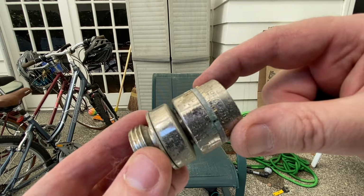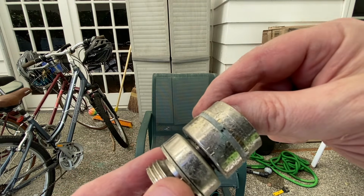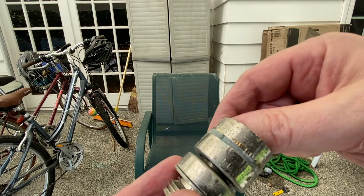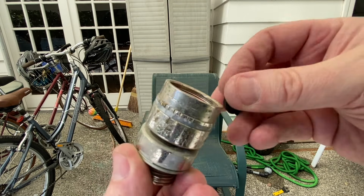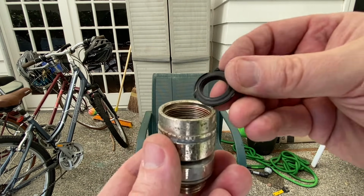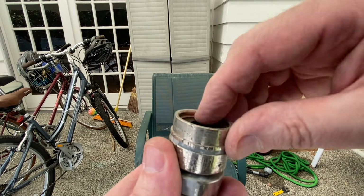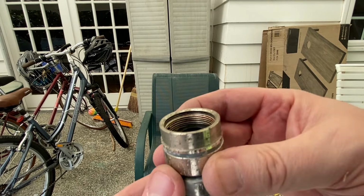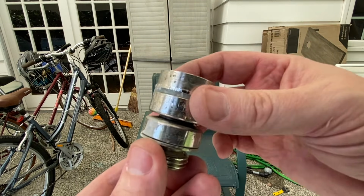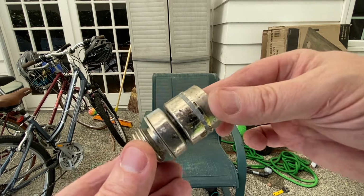So if you wanted to just replace your vacuum breaker, you still could. This is a 1019-A486. And what I would do is, instead of putting more thread locker on and getting this to where it seals, I would actually just take a hose washer, put this down in there, and then connect that like that, right? It's going to do the same thing as the other, and then you've just made this removable.